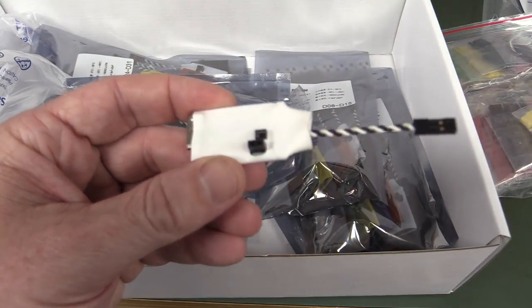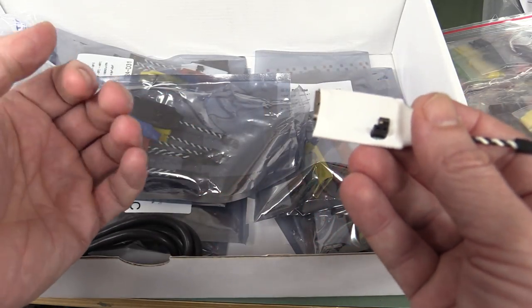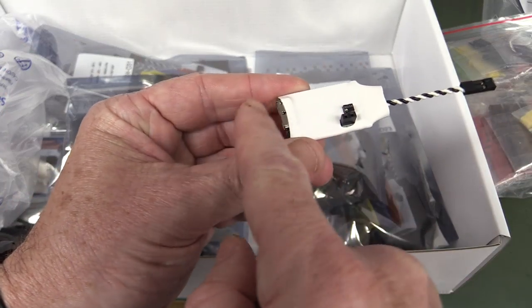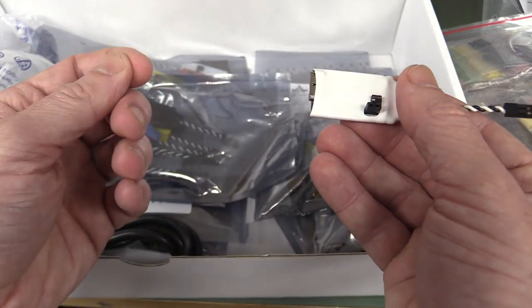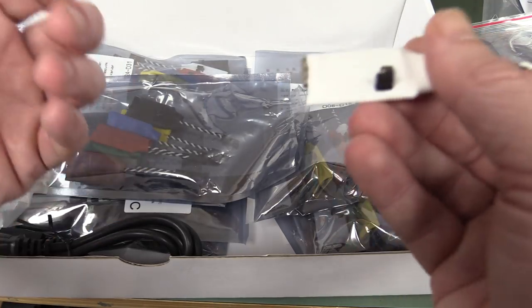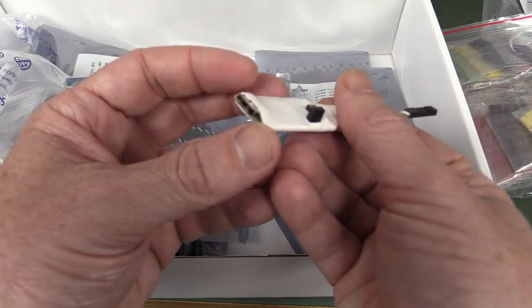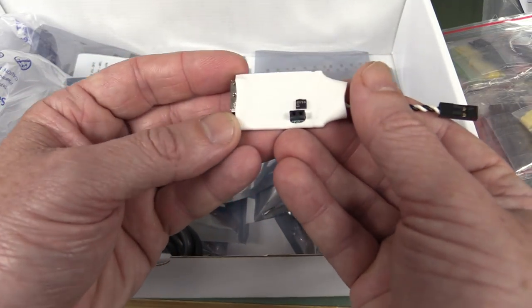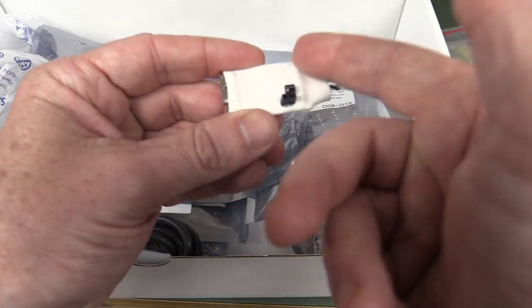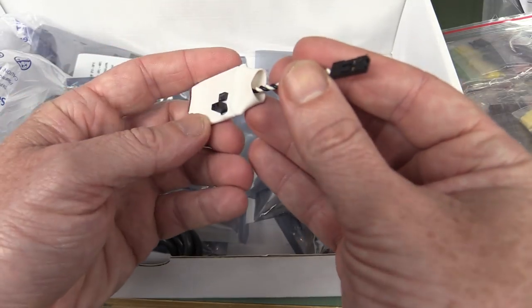So they use the USB 3, of course, to go over to the unit. And there's nothing wrong with that. This won't actually be a USB interface. They're just using the USB 3 cable for its ubiquitousness, its cheapness, its controlled impedance, everything else for high speed differential pair. So that's basically what they're using the thing for. They're probably transferring some power over as well. So USB 3 was actually a smart choice there.